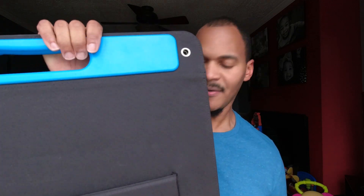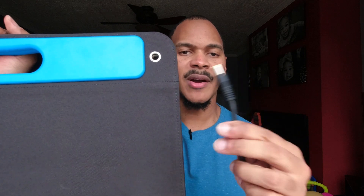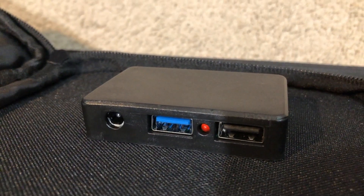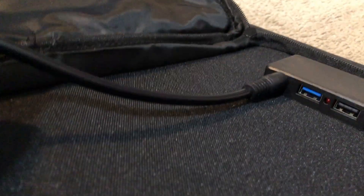Here we have the X-tar, which is another bi-folding panel. This one is more along the lines of the Jackery, where it has an 8 millimeter built into it — this is the only connection that it has. A lot of solar panels have a port on the inside, typically a female barrel-style connector, and they'll include a cable — like a 5525 male-to-male cable — that you plug into the solar panel and then into your respective power station. A lot of folding panels have a cable that's built in, so you don't have any options with that and just have to adapt it at the end.